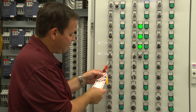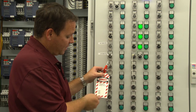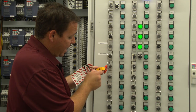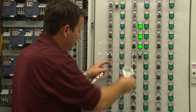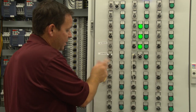We can also put a tag on here through the lock. This is going to say who the equipment was locked out by, the time, and any reason for lockout. When I'm done performing my service, I can come back over, insert my key, remove my lock, open this back up, take it out, and put my Omni back into the auto position to return it to normal operation.